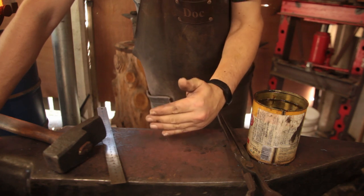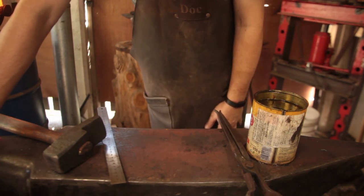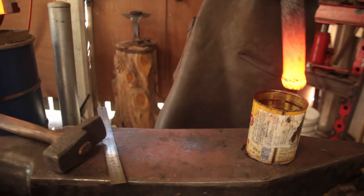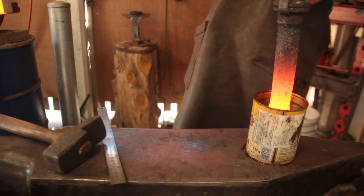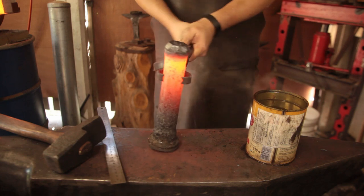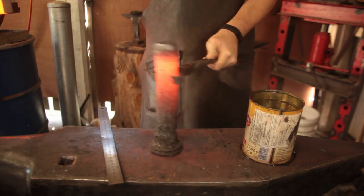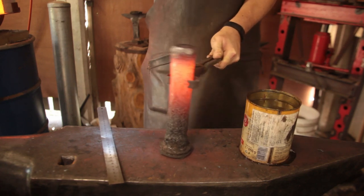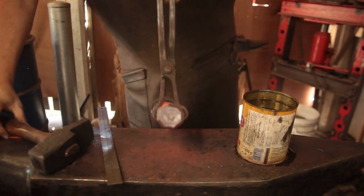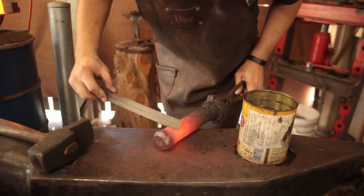So what we're going to do is we're going to chill the first centimeter or so, it acts like a driver plate, and we'll push the hotter metal underneath it further. So it's not something I like doing with mystery steel, but I'm 99.9% certain this is wrought iron, so it's not going to matter. But we'll see what happens. As an aside, wrought iron doesn't generally like this anyway. It tends to split. But that got us a lot of the way there.